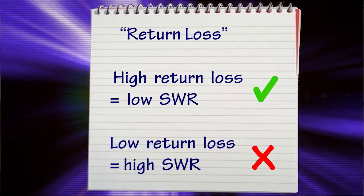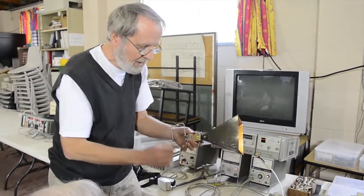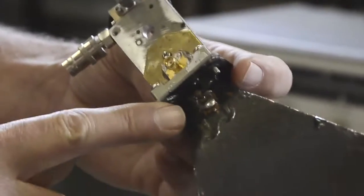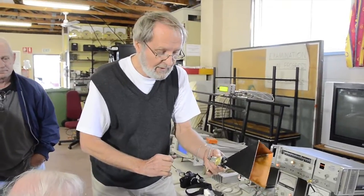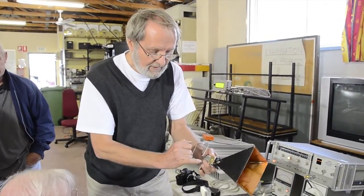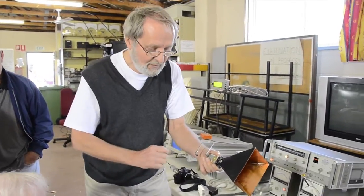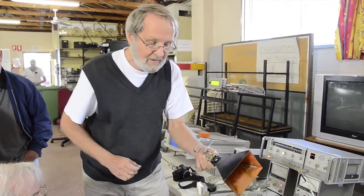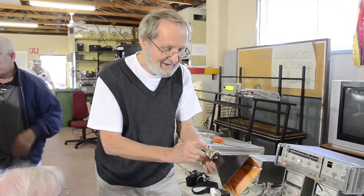We've had adjustments with this 10 GHz horn and we're able to achieve more than 20 dB return loss by adjusting a little adjustment screw, which was found experimentally to be the right place using a ball bearing and a magnet — moving the ball bearing around on the inside and the magnet on the outside. So that's quite a lot of fun when you get into microwaves.